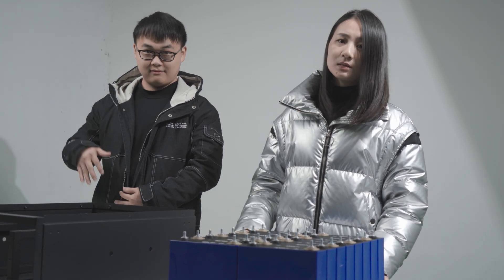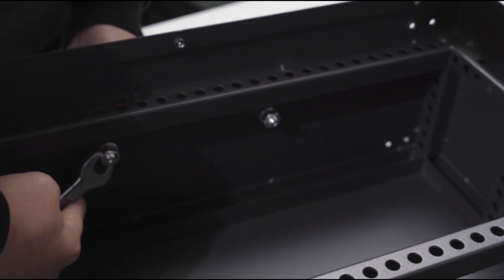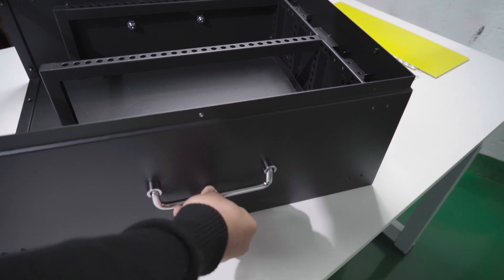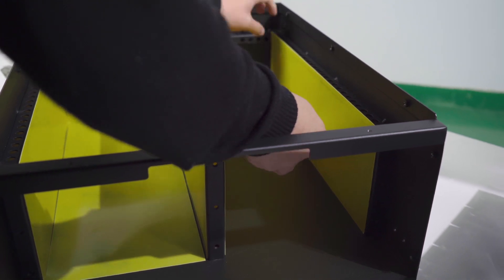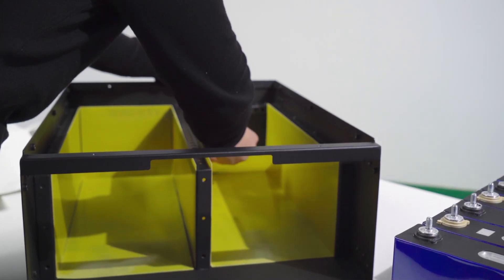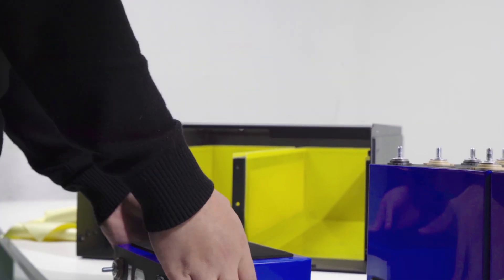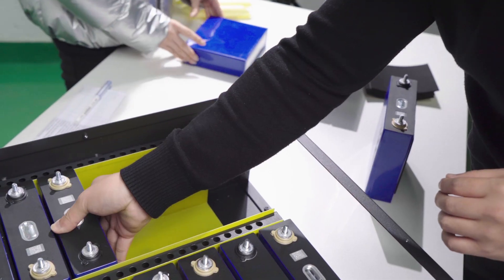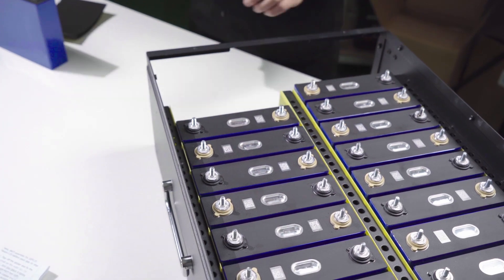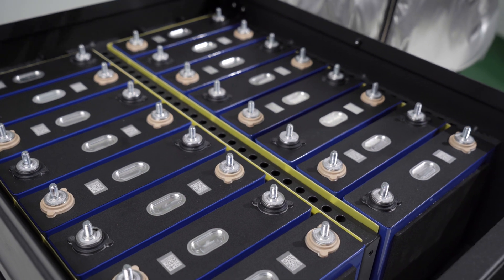Next, Aaron will assemble the Mesa battery pack step by step. First, install the handle. Then stick the insulation sheet around the metal case for cell and case insulation, as mentioned before. Stick EVA tape onto the battery cells — for the end cells, both sides should be taped. Then put all the cells into the box according to the diagram.